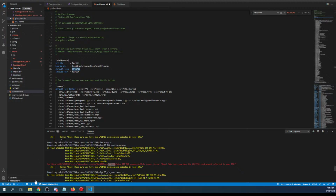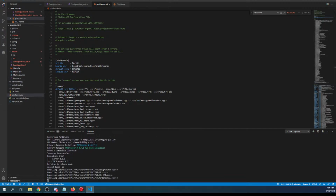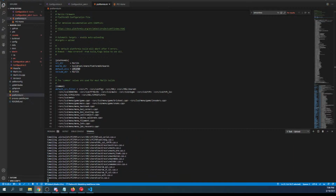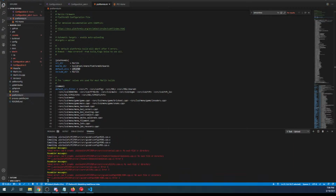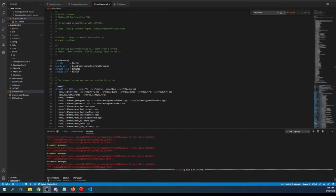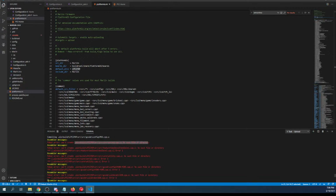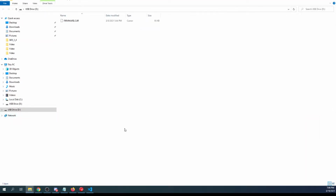So now that we got that set, we're gonna try a compile and upload again, or build. And I'll check on the chat in a second, and hopefully that won't fail a second time. Okay, it is failing. So now we got to figure out what's going on here. So it's saying no such file or directory. So I'm going to go over and check to see if there's actually a file folder. So let me bring this to where you can see it. So right now, this is the previous build that's on the device. We can see the device, so we know we're good connected that way.